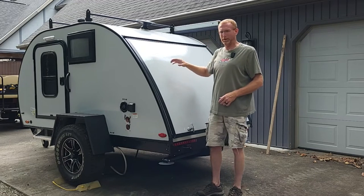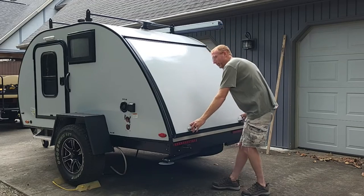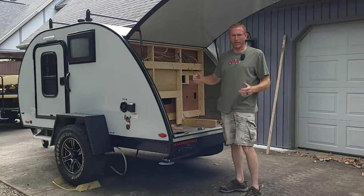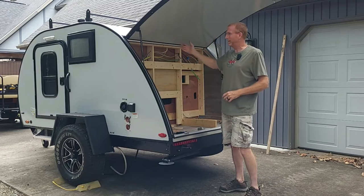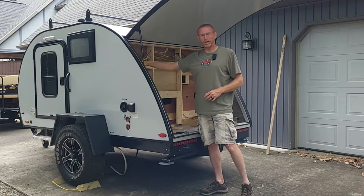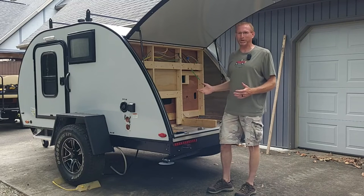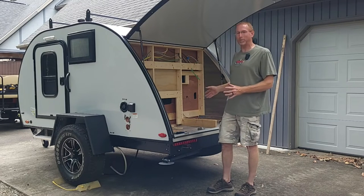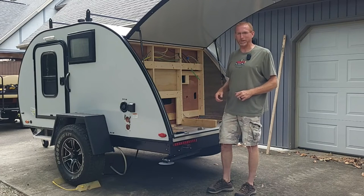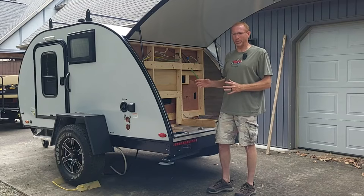The main issue with these and the big problem that everyone has is that when you raise the lid up and you've got any water on that door, or if it's a light rain or a sprinkle, that water starts running down and runs in the corners of the door right up here and drips right down into that upper shelf and collects in the upper shelf. As you can see our upper shelf is gone — I'm in the middle of a major galley renovation here so I've got everything wiped out, but I had some time today and I just thought today would be a good day to show how we're going to replace this hinge.